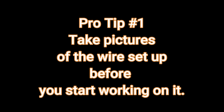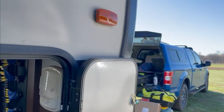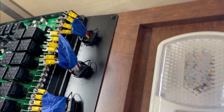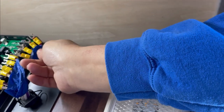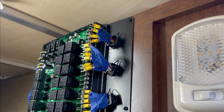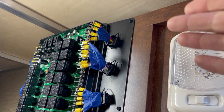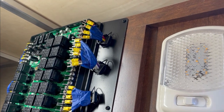What we're going to do — because we are in such a tight spot — is use painter's tape to separate some of these wires. As each one of these comes out, we're using the painter's tape to keep them in sequence, so when we go to put this back together it's going to make it a little bit easier.